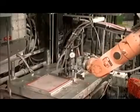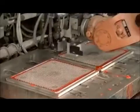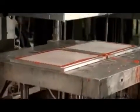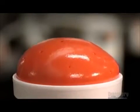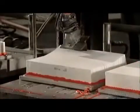A robot dispenses a liquid polyurethane mixture around the screen in the bottom mold. Then the automated platen flips back so that the top molds with the paper packs face down. An air cylinder pushes a platen holding the bottom molds up to meet the top ones, and heat triggers a chemical reaction. The polyurethane swells and covers the screen and the paper pack, forming a solid, flexible plastic layer.